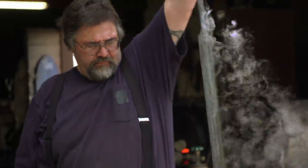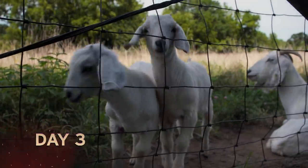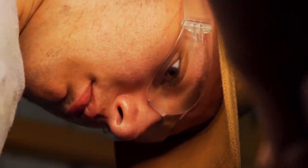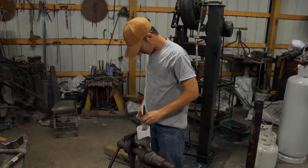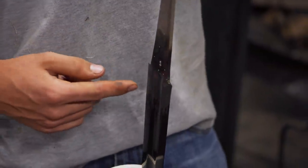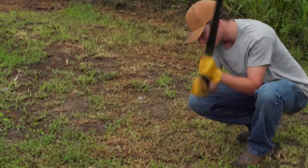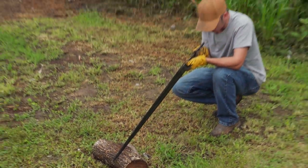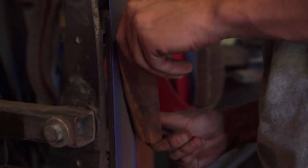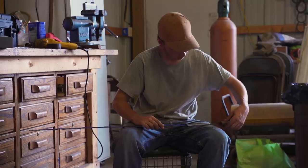I pull it out of the quench and it comes out almost perfect. All I have to do tomorrow is fit and finish — guard, handle, pommel. The theme of day three is handles and guards. All that needs to be done is etching and sharpening on the blade. I'm going to acid etch the blade now, let it sit in there for a few minutes. The top of the blade is not hardened as much as I would like, so I want to make sure it's not going to take a bend or a set. It seems to have held up pretty well. It's the end of day three — I have a finished blade, the guard fit up, and the handle shaped. All I have left is the pommel.